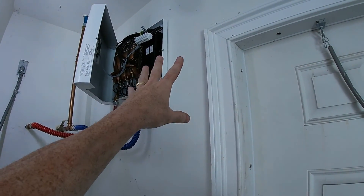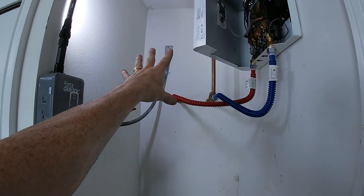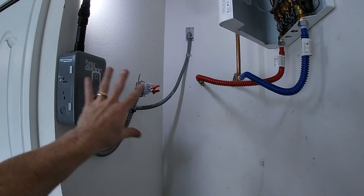Before I start working on the sub-panel in the next video, I'm also going to remove this armored cable and put a cover on that outlet over there because this will no longer be used — this was a timer I used to turn on and off the water heater that used to be here. I don't have my sub-panel and extra breakers yet, so I'm waiting on those, and I will get those installed beginning of next week. I'll film that as well and get it out to you as a part two so you can see how to install a tankless water heater. Your amperage will probably be different than mine, but you get the basic idea — the only thing that varies is really the wiring and the amount of breakers, and you may or may not need a sub-panel. Like it if you like, subscribe to keep up with my latest shenanigans, and I'll see you in the next one.